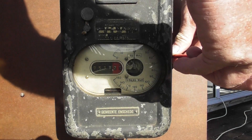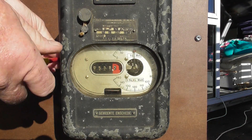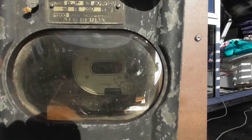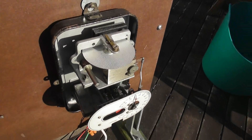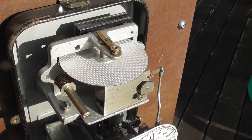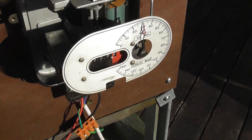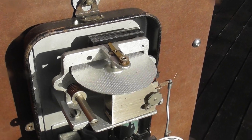I'm going to decase the meter — take the cover off. And here we have the inside. Absolutely beautiful piece of equipment. It fits in the LJC series. We've got a Ferraris disc driven timer — a 15-minute timer which has an adjustable screw, accessible via the outside for calibration purposes by this sealed knob next to the device. It's driving the mechanism. Beautiful old metal gear train.